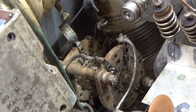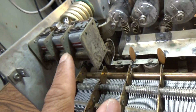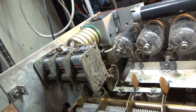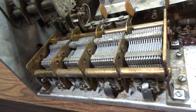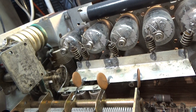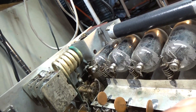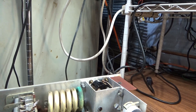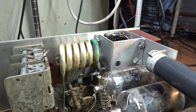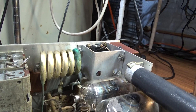Getting rid of the band switch makes it a better amp — more direct, a little bit cleaner. You wouldn't need all that extra stuff; the whole extra coil section and band switch could go. I haven't decided yet whether I'm going to keep all these big capacitors or change it to something more economical for this amp. Anyway, that's all I wanted to show on this one: what you need for 10 meters only. Remember, with more coil turns needed for fewer tubes, and fewer turns for more tubes — that's it for this one. Bye.